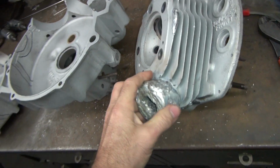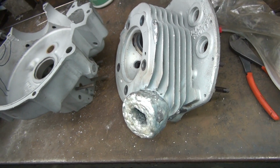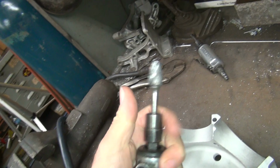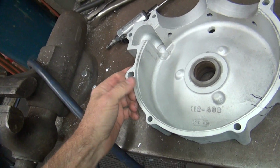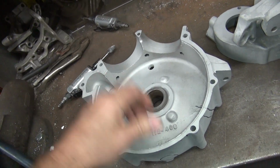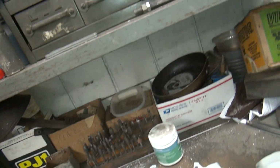So this here is an exhaust spigot. You got to cut it round when you're done. I use hard material on this because I want to machine it. Soft is very gummy material when you go to cut it. When you're filing, grinding, using files, sanding, it just gums up everything. It's just crappy material to work with. But it's fairly consistent on its strength, whether it's hot, cold, or in between, up to a point. So that's why most people use it. I don't like it too much.